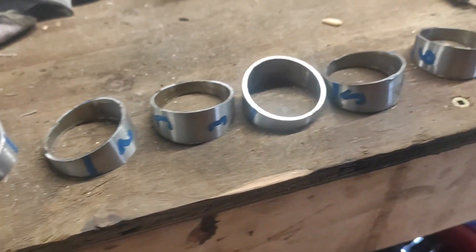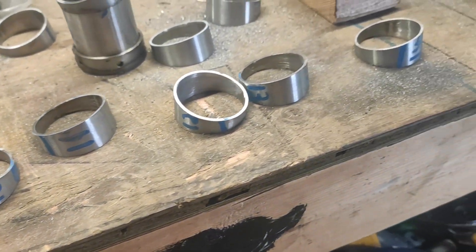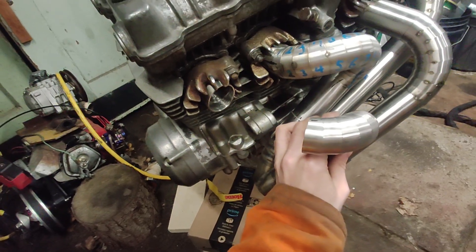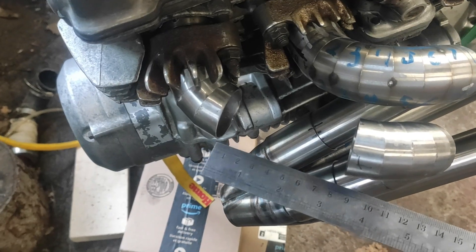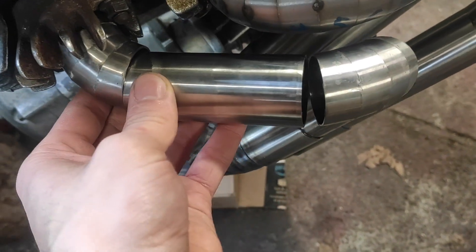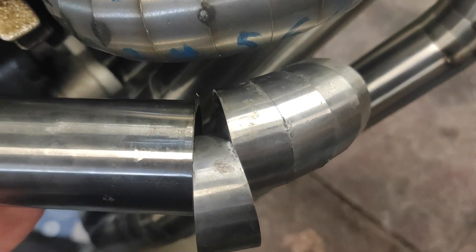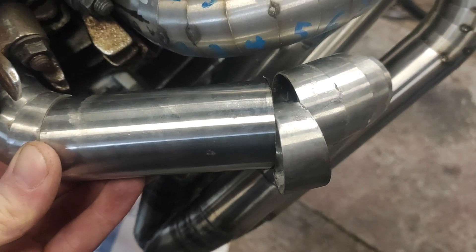I ended up very carefully marking each one of my curves that I super-glued, then breaking it all apart, sanding the faces to get all the super glue off, and then lining up the marks again as I tacked it together. You could try tacking things together with the super glue on and then soaking in acetone, but it might take a really long time for the acetone to get into the cracks. But it might be worth a shot. In any case, we have reached the final part of our adventure — our level 4 header. This one was the perfect example of fixing both ends, one to your collector and one to your exhaust port, and then adjusting the middle to fit. I left a straight piece and one pie unglued from the rest and just adjusted the straight piece on the grinder; the other pie was out just for clearance reasons.